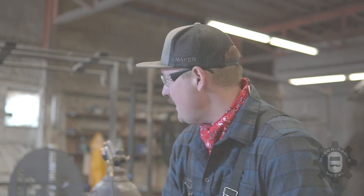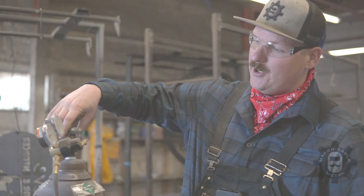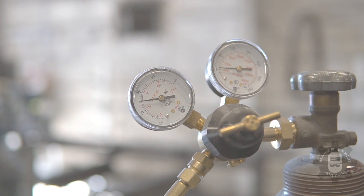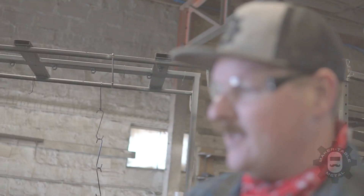Once your polarity is set, you need a bottle of 100% argon — no mixes for TIG. It's kind of expensive; you just have to bite the bullet if you want to go to TIG. Set it around 25 pounds to start. This machine has a regulator inside it to turn the gas on and off when you start and stop welding — pretty slick setup.